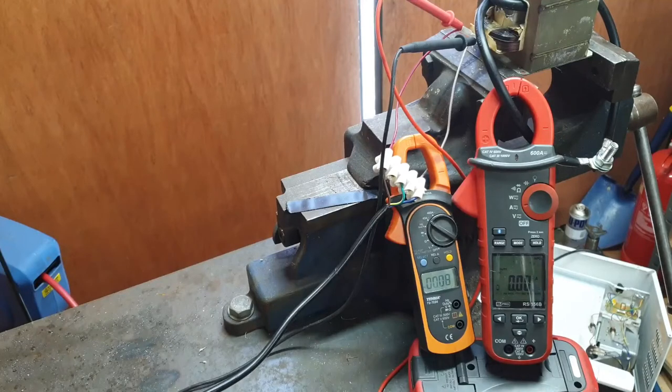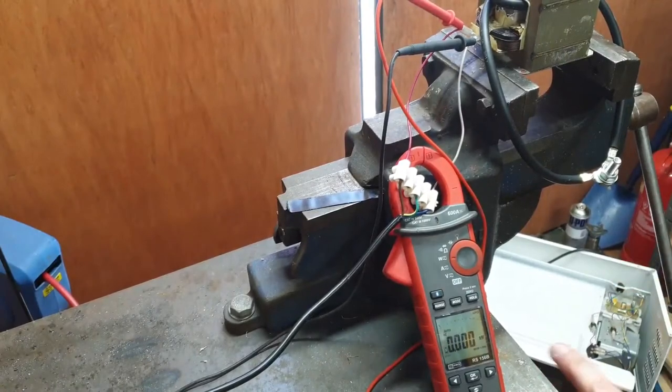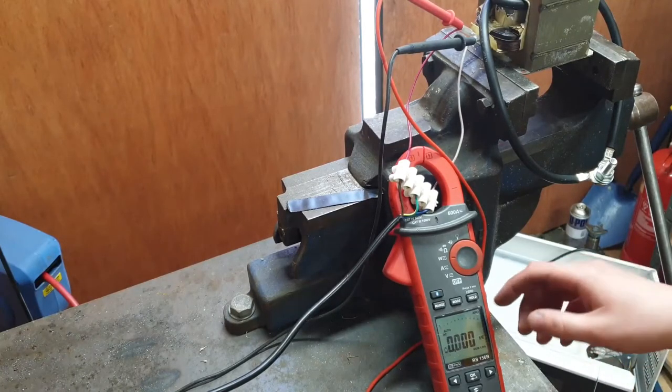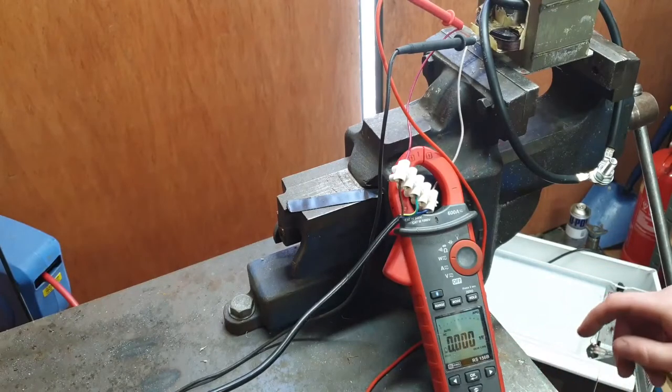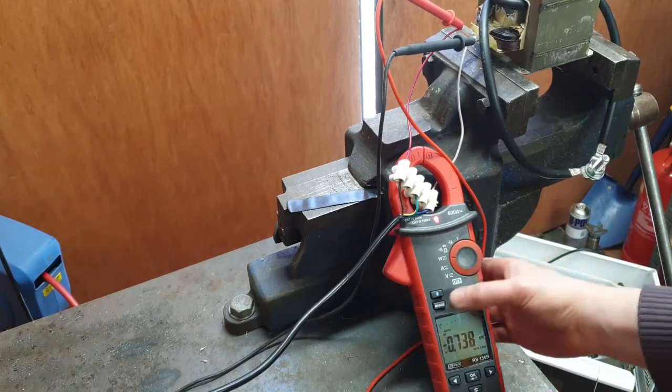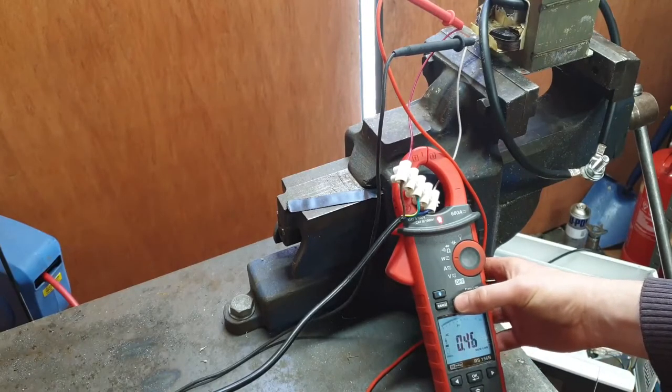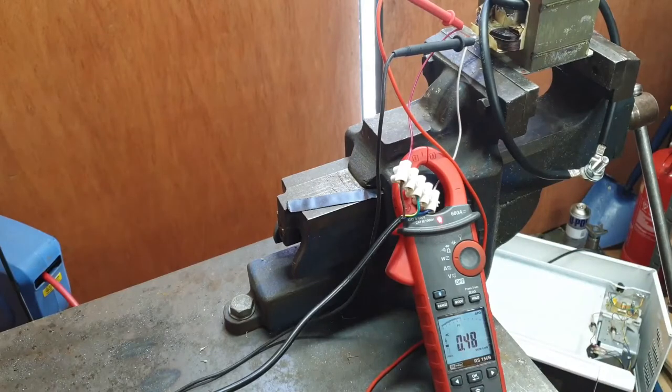Next thing to do is now to measure the power going into the transformer now that it is short-circuited. Right, I've now got the clamp meter set up to measure the power of the input. I'm going to go through this quite quickly because the cables are getting a little bit warm. Turns out 16mm cable isn't really very good for 700 amps. So currently it's off, it's reading 0 watts. On, it's reading 700 watts. Power factor is a bit better now,